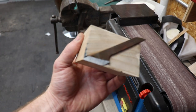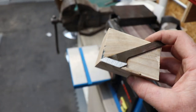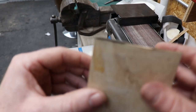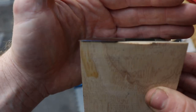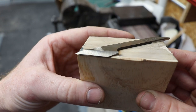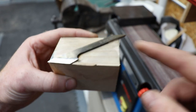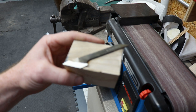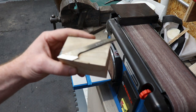We have our 20-degree bevel cut into the knife now. Taking time to make sure we don't overheat this blade because I'm not tempering it again. You can just see it coming down to a nice fine point. I'm going to finish it off on the sharpening system. Do the other one exactly the same way, just facing the opposite direction. Take your time — if you're not re-tempering the blade, you don't want to see any color changes in the steel while sanding.